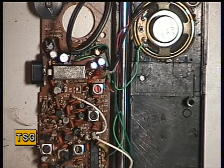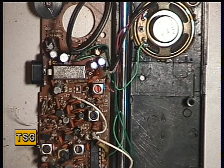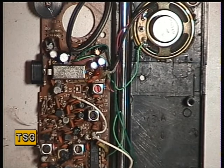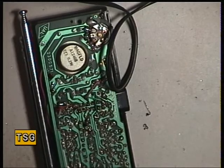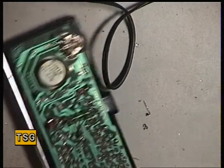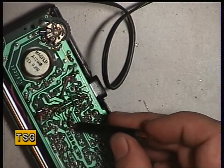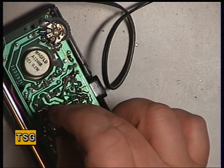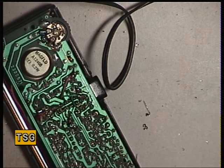Like the 1006 and the other one, the 1003. So I'm going to put this back together, put that loading coil back, and we'll go through setting up the rod antenna. I've put coil 6 back in, which is the loading coil for the rod antenna, and I've put the printed circuit board back in place. There's a hole through the printed circuit board to get your trimming tool into the adjustment underneath — that's well thought out.